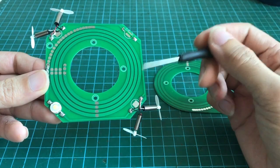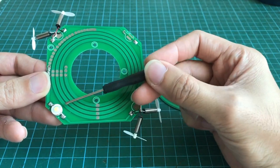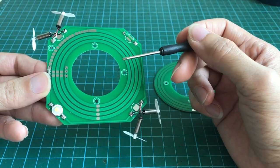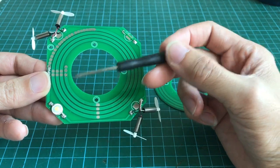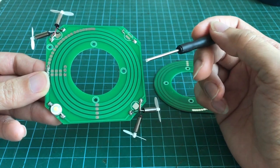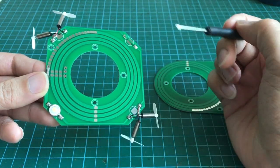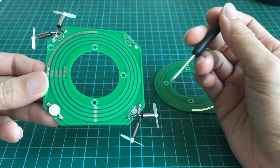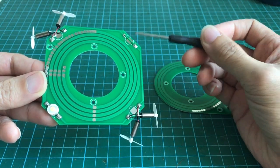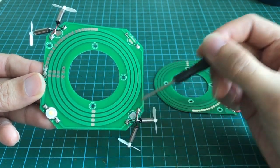I've removed three LEDs and left only one LED on the reception board. This LED is actually needed to drive the DC in one direction, and this one LED alone consumes 0.9W of power. The good news is the total power consumption does not exceed 4.8W. However, having one LED leaves us with only three output ports available for four motors. To solve this, I've hooked up two motors in parallel to each output, and for the one unused port, I connected a jumper wire to allow continuity of the series circuit.